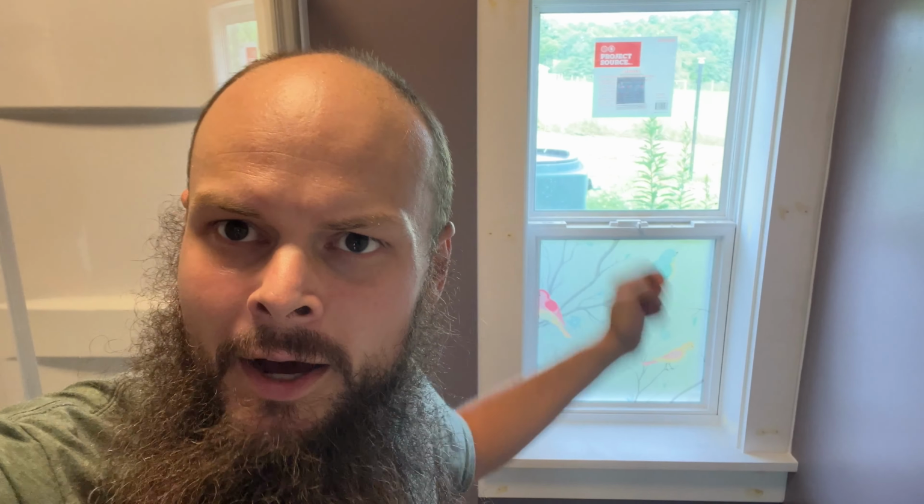Well, behind me is the, I would say, 90% complete window trim. You can see these little brown globs. That is the wood filler that I use to fill the nail holes. That will dry, and it's not going to be as noticeable once it dries, with that color, I mean. But then I'll sand it down, and I'm going to give this a full, fresh coat of enamel trim paint. I'll probably do that with the rest of the windows once those are trimmed out.